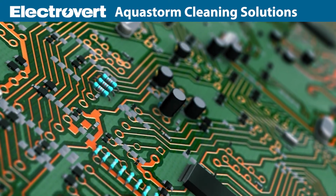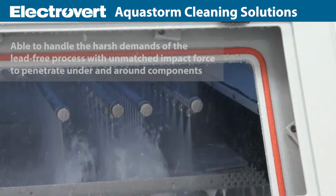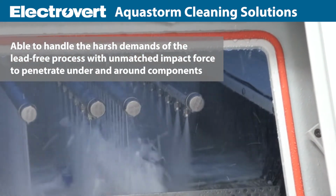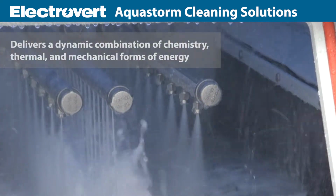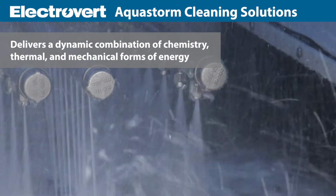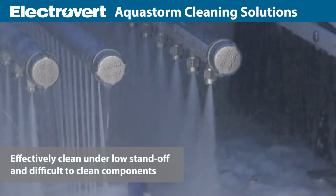Flux formulations for lead-free soldering leave more residue and dramatically increase the need for cleaning. Aquastorm is able to handle the harsh demands of the lead-free process with unmatched impact force to penetrate under and around components. The clear advantage of Aquastorm cleaners is the ability to deliver a dynamic combination of chemistry, thermal, and mechanical forms of energy at the surface to effectively clean under low standoff and difficult-to-clean components.